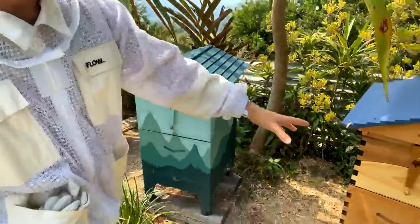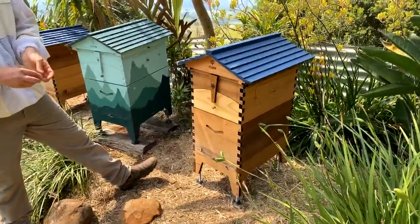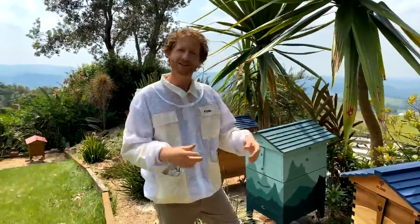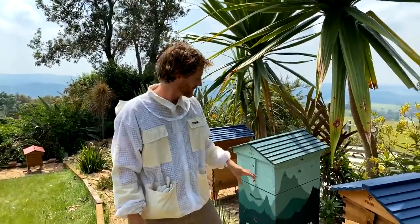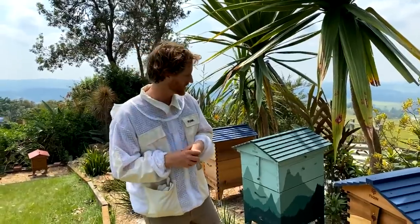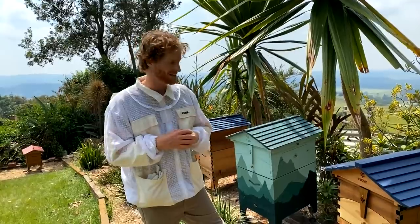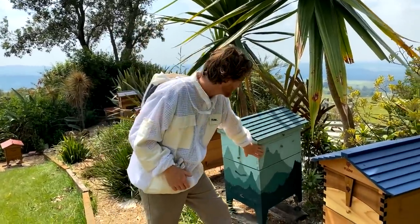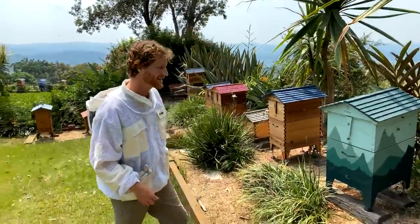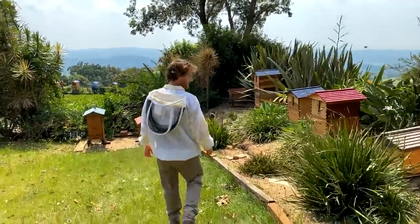The Western Red Cedar has natural properties to resist mildew and things like that on the outside. The mildew doesn't damage your box, but it just doesn't look so good. Whereas the Araucaria doesn't, so it will tend to get that mildew on the outside in the first 3 to 6 months. So painting the other wood types, be the Araucaria or Paulownia, is a better idea. If you want to keep that beautiful natural wood look, then the cedar is the go.